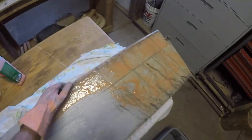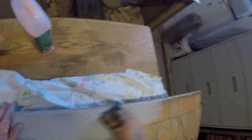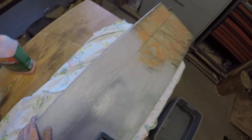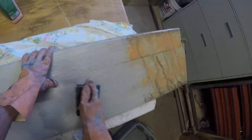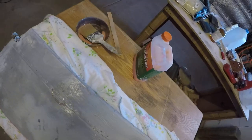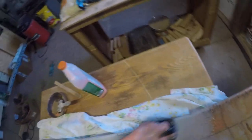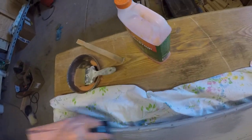There'll be some scratching on the surface that I'll have to polish out. I have some abrasives coming in to handle that. It's really good aerobic upper body work — it's like paying my dues getting it off. Kathy and I didn't know any better when we did it, so that's the way it goes. It's going to take at least one more try, possibly two, to get the rest off — this stuff has been on a little over an hour munching away. It softens epoxy. You can see the pad is pretty well filling up, so we move to the other side because the law of diminishing returns is kicking in.